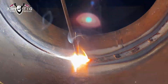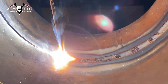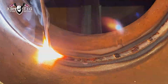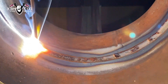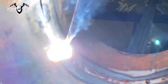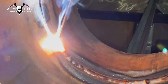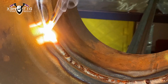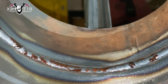Same thing — back feed, couple mils above that root, connected to the edge of the liquid puddle. Just keep it connected. Depending how fast your rod is burning and your tungsten inclination, you gotta feed that hand. But now you can already see the difference — the profile is a little bit lower than at 120 amps. So even in the field, if you're at 120 and it's burning too fast and you really have to feed fast, slow down and go down five amps. That's why we always say in the field: up five, down five. Five is a magic number. This is 115 amps — the bottom is a little lower profile, and as I'm going up it gets a little heavier, but that's when you push that rod closer inside that root.